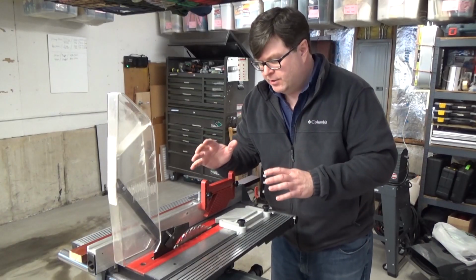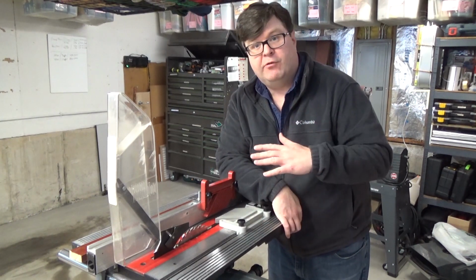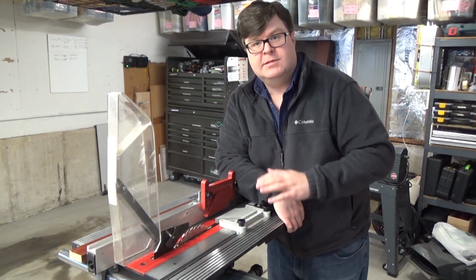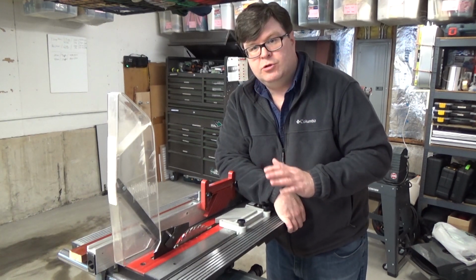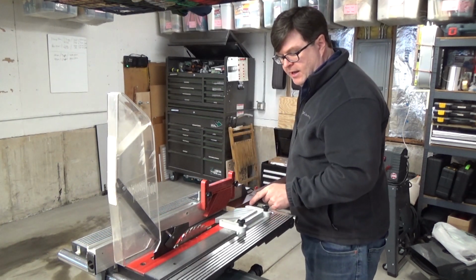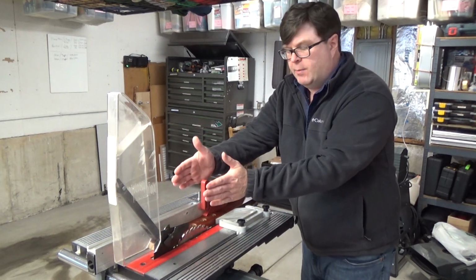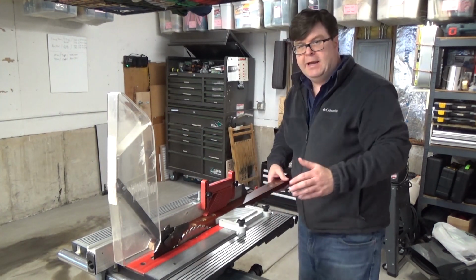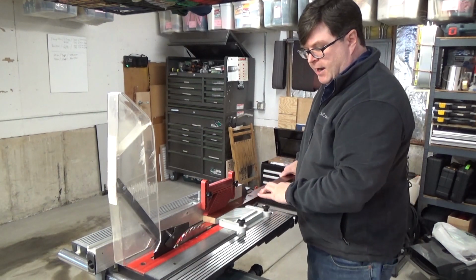At the table saw is where our kickback conversation really heats up. Once again, I'm going to refer you back to the Paul Anthony article, which really contains what I consider some expert information. He breaks down kickback into 2 categories. The first category he refers to is when feeding workpieces in a rip cut and the workpiece getting caught between the fence and the blade and ejecting backwards. Of course, I can mitigate that risk by not standing here, but standing off to the side.